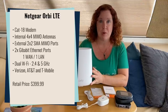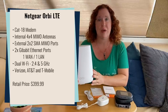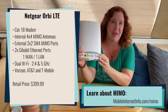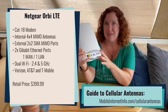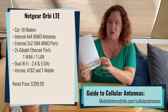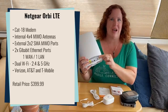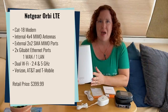With that Category 18 modem — that's kind of the pinnacle of LTE — it's got 4x4 internal MIMO antennas. It does include cellular antenna ports, but only two of them. They're SMA connectors, so you'll need to find SMA exterior antennas to get a better signal to the device. Just keep in mind, it has internal 4x4 MIMO antennas, so when you use the external ports you're taking it down to 2x2 MIMO, reducing that diversity — but sometimes those extra ears on the outside can be the key to a better signal in some situations.